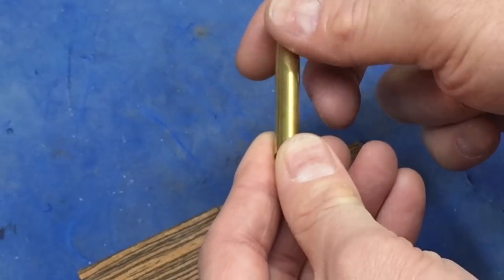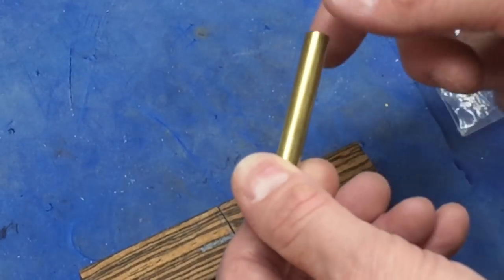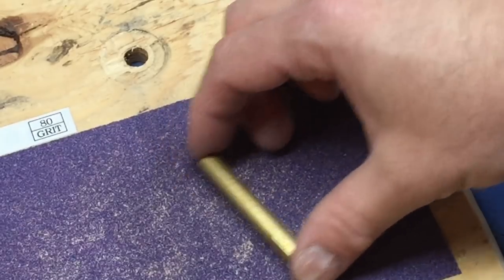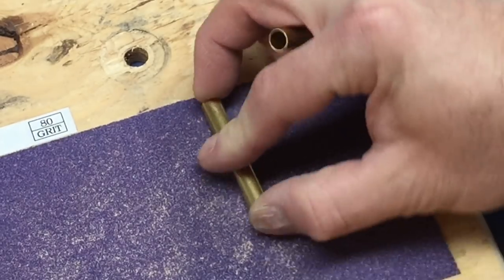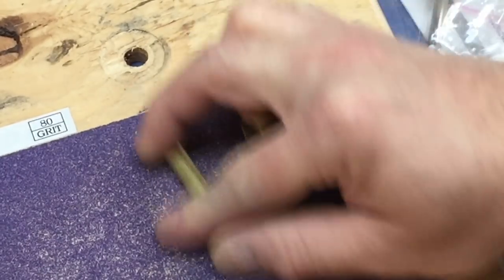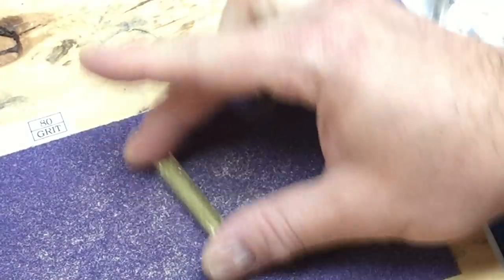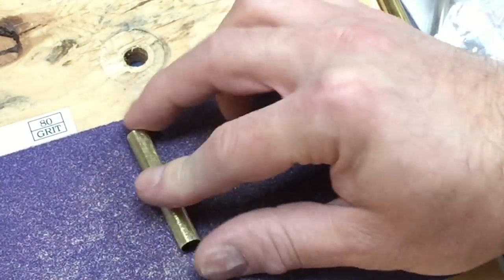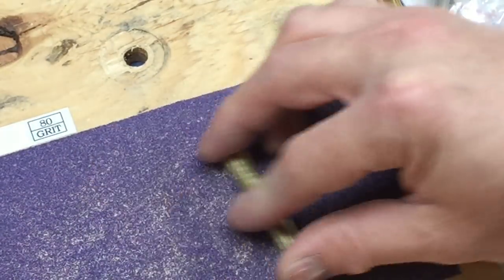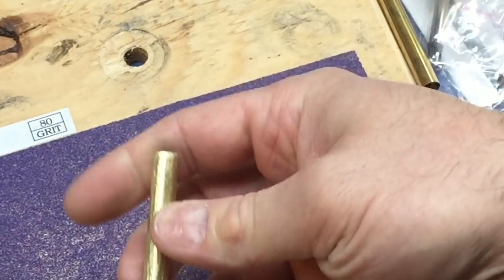All of the kits I purchase — about 95% of them — the brass tubes come very silky smooth and slippery, and you're going to want to rough those out so they adhere to the wood better. When these tubes are made they come with a coating that really needs to be removed for them to stick well. I use 80-grit sandpaper and just hand-scuff them in different directions. I do purchase some kits where the barrels come pre-scuffed, but that's not often.